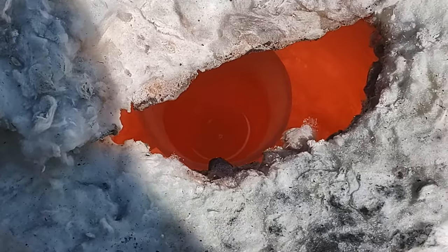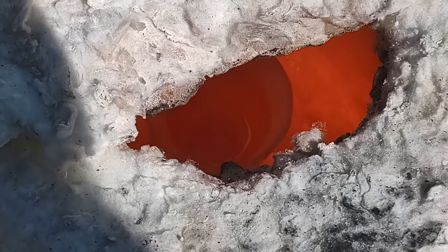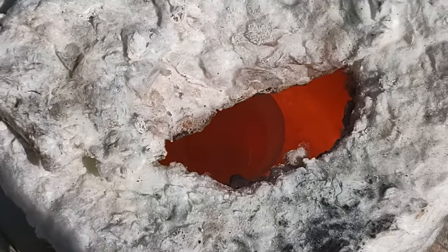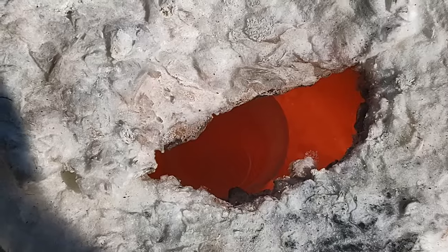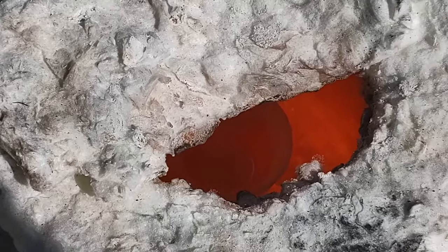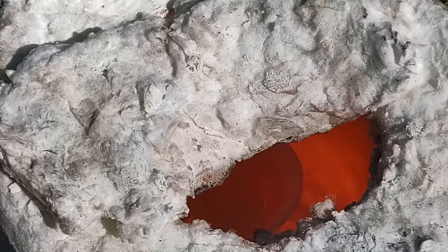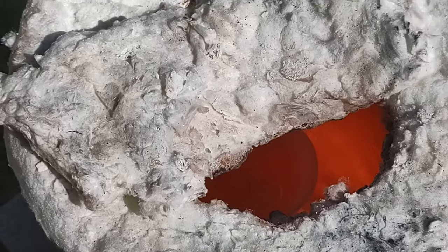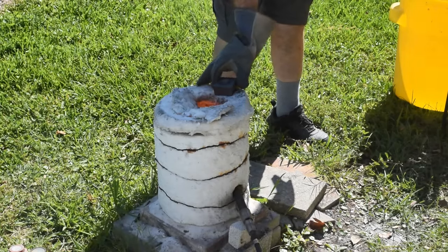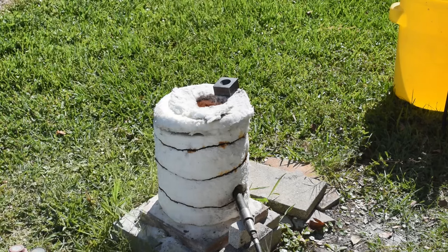The liquid's all melted, it's still bubbling, and I see little beads of metal on top — probably the lead. I'm going to let that sit in there on high heat until the bubbling stops and the liquid just lays flat for a while, giving the gold a chance to migrate down into that puddle of lead at the bottom and the little lead droplets to migrate down and join it. Then we'll pour it off into the cone mold, but it needs to cook for a while — maybe quite a while. Some authorities say to leave it for as long as an hour.